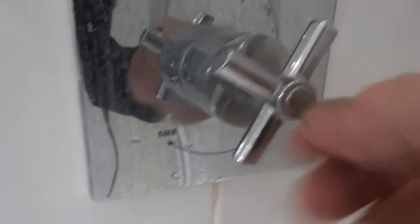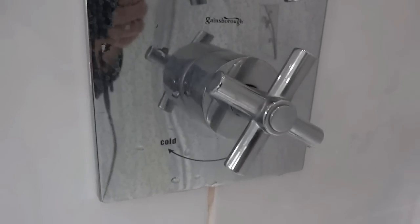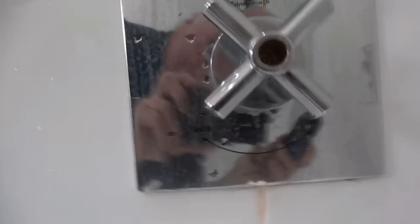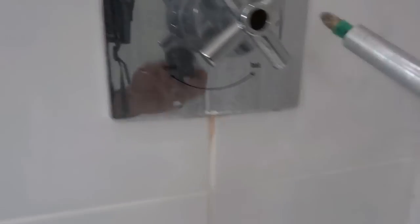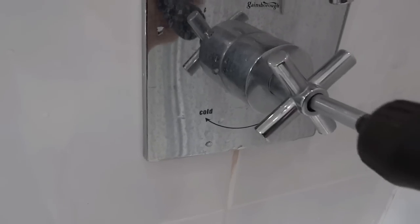The first thing is this balance control between the cold and hot — this is where our fault lies. First we've got to get a little screwdriver behind here and just pop this off. Once we've done that we'll find a screw inside. There is a posi screw in there, so I've got a posi driver to get that off — just put it in there and undo it. Then the handle will just pull off.